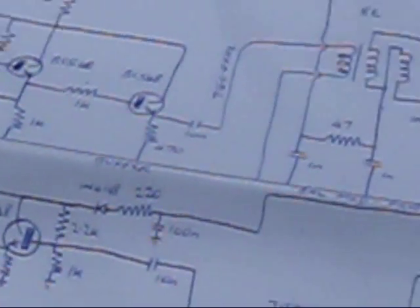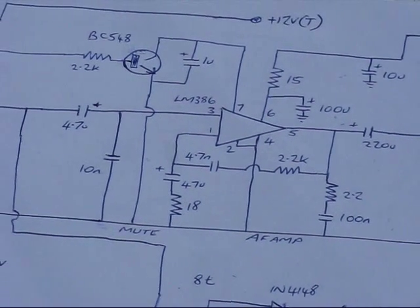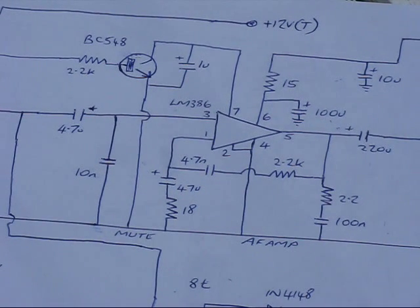From there, following where it says 'A' on the diagram, it goes into the balance modulator — or rather the product detector. That is mixed with the signal from the local oscillator on 7.160 MHz, and the difference frequency is fed to an audio amplifier circuit. The first version of the Novelist Wonder had two BC548s as the audio amplifier, which worked and comfortably drove a pair of headphones. However, as a radio you might want at home monitoring a particular frequency, that's inconvenient — you want a speaker so you can hear it from another room. So I replaced it with an LM386, with a few more components than usual for a higher gain than normal.